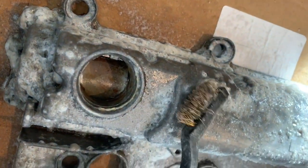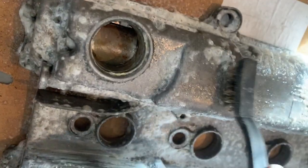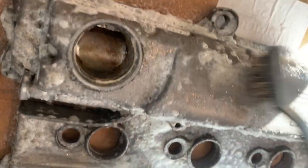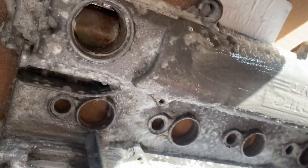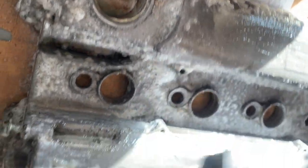It's been about five minutes. I'm going to take this brass bristle brush here. Why brass? Because I don't really want to scratch my aluminum — steel is obviously harder than aluminum, so you could scratch it. I'm going to scrub at it for a while and do a whole bunch of scrubbing.